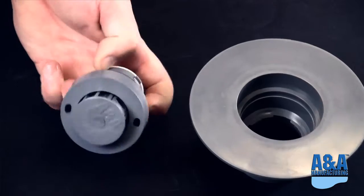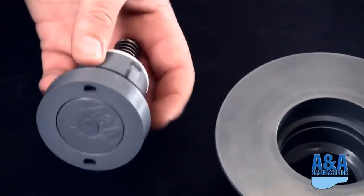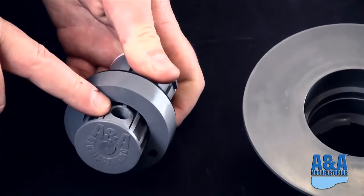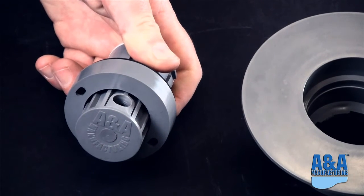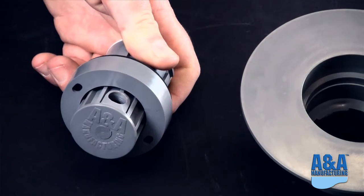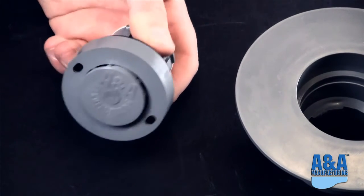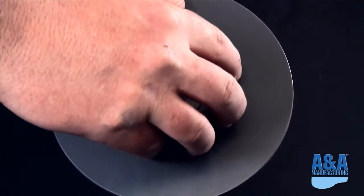Just like any of our other heads, it's a rotating ratcheting head. You can always tell your high flow and low flow. This is a high flow 7/16. We also make a 1/4 inch low flow head for this. Typically your low flow is going to be on your steps, benches, sun shelves, beach entries, things of that type. And this will just drop right into the turbo adapter.